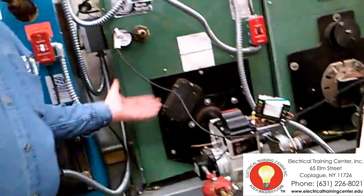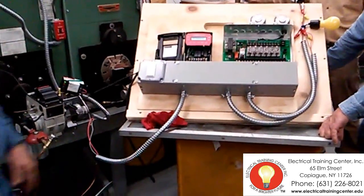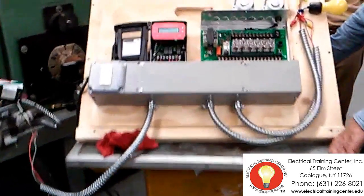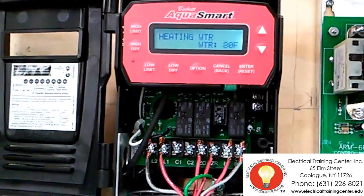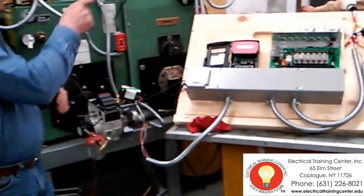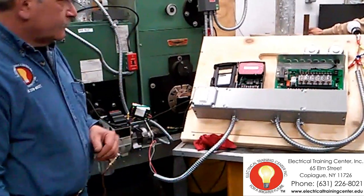The burner is firing into the boiler, monitoring water temperature through that high and low limit extension probe that goes into the well. Watching this, you'll see that the temperature in degrees will start to rise. When it rises to a point of either the low limit or your set high limit, that will either turn the burner off, or if a zone is calling, you're now going to have heat coming out to that zone. And that's all monitored by the AquaSmart.